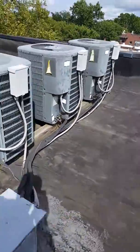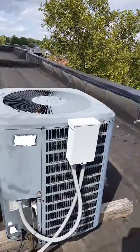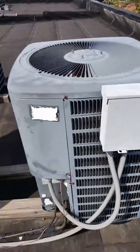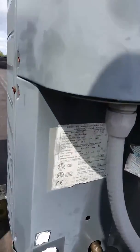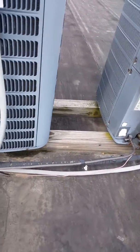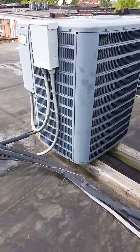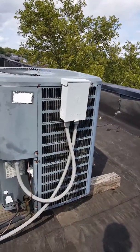Hey guys, we're looking to replace this last air conditioner down here. It's for unit 301. I marked it, had the customer turn it on. Got a fan motor not working. It also has a leak in it, so we got a 2-ton AC system. She wants to replace, we'll flush out the lines. I'll check on the disconnect and whip what we need to do.